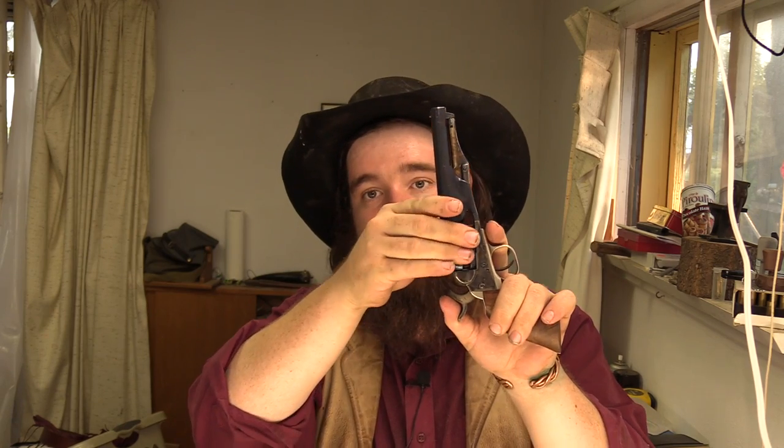I got tired of messing around with that and decided to make more major adjustments. I wound up filing a big notch in the bottom of the bolt to accommodate that 45-degree shape in the spring — I'll have a picture of it up here. There was not enough space between the trigger guard and the bolt to fit that curly Q spring in there, so I had to notch the bolt down to accommodate it, and it worked out just fine. I also had to do a little other work because the bolt was coming off the cam too soon. I played around with the trigger and took a little too much off of it, but it still works fine. Now you can turn the cylinder at half cock and bring her back to full cock. That little bit of extra work on the trigger is probably going to lead to it shooting high in the footage.